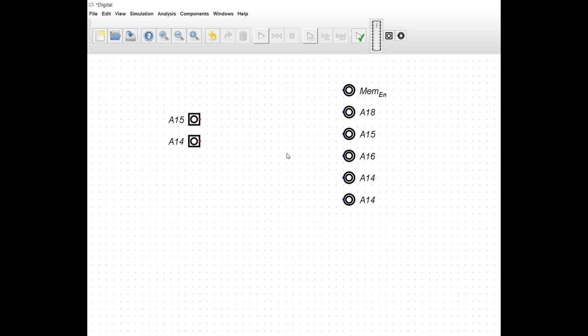Because 1 bit can give us 2 values, either a 0 or a 1, that can tell us whether or not this is going to be a RAM address or a ROM address. So we need to come up with a way of taking 2 bits and turning it into 6 bits. Okay? And the easiest way of doing that is to have an octal latch of some type that we can actually take 6 data pins, latch the information from it, and send it over to these bits when that particular area of memory is enabled.